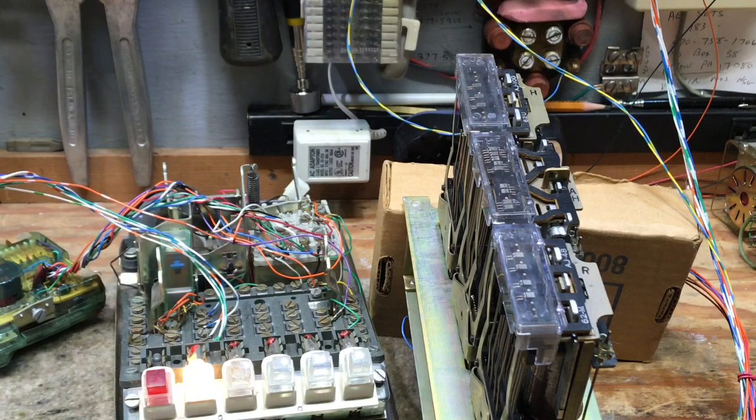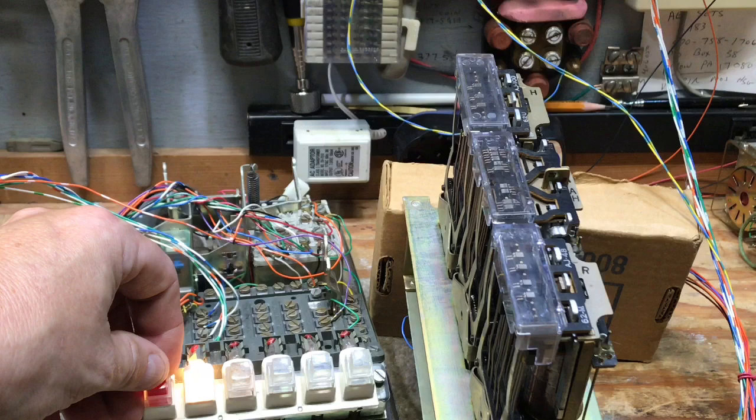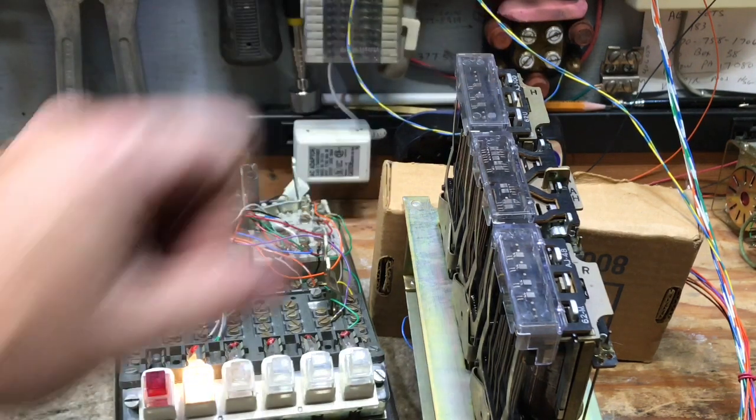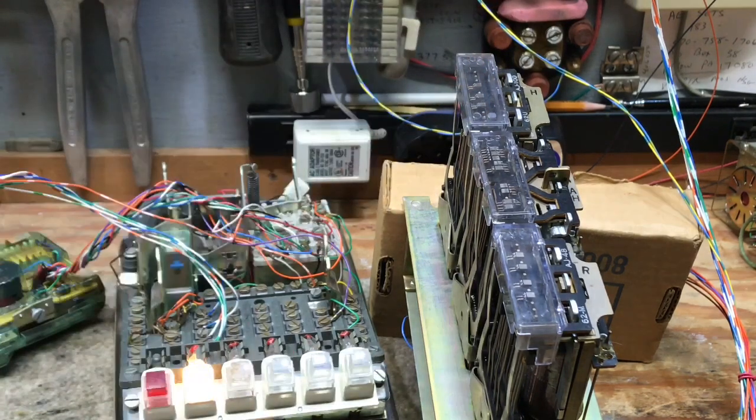When you go off hook, through the series of the contacts in the A and the AH, it releases the R. Also, if you look at the very top relay, when I press this on hold, that will be operating as well. So right now, the H relay is operated. The phone line is actually going through the relay coil to hold the line up, and then at that time it starts the interrupter and then switches the lamp circuit through to the lamp wink on the telephone system.